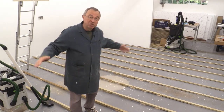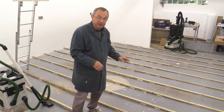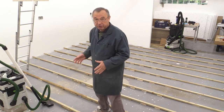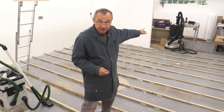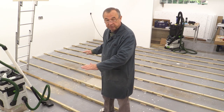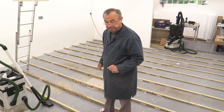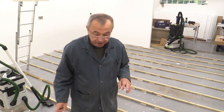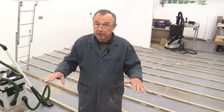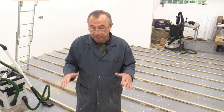The first part of the flooring in this large area of the workshop is now complete. I've put the battens in and they're pretty much level, within about a millimetre or so. The next stage is to cut some polystyrene — you might just be able to see it against the wall over there. I'm going to cut that into strips so it fits down between the battens, then put a layer of polythene on top as a moisture barrier, and then the chipboard flooring goes on top of that. Ordinarily with this method you would put grip fill along the tops of the battens before laying the chipboard, to stop creaky boards — but I'm not going to bother with that for a workshop.